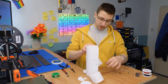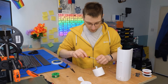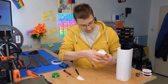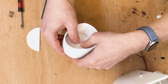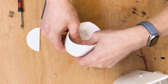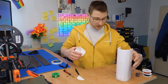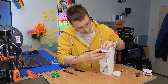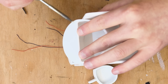Because this motor is a little bit higher up, make sure you give it a little bit more wire. Again, screw in the mount, put the shield in making sure it's orientated correctly with the motor shaft — it is keyed so be mindful of that. Push it down enough so it's firmly on there but not enough that it scrapes the bottom of the container. Then screw the container on, and the last thing is that little front lid.